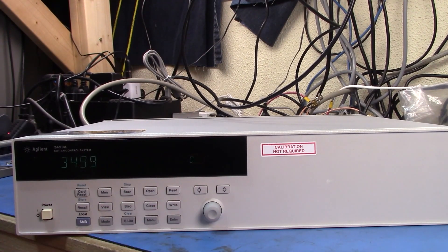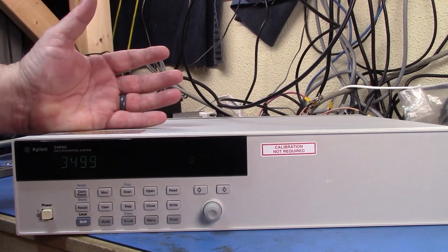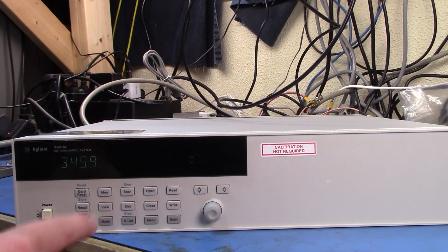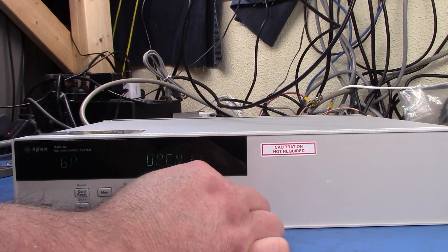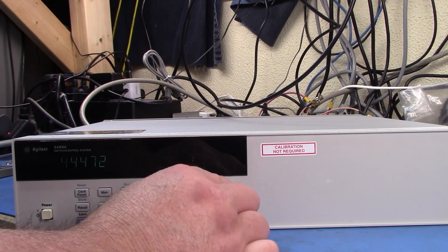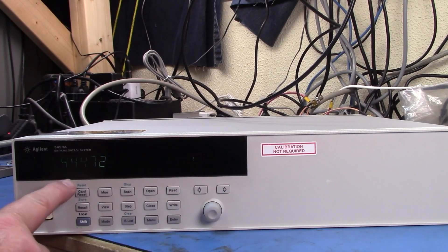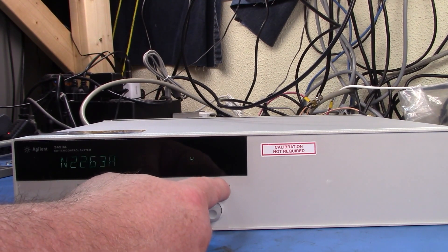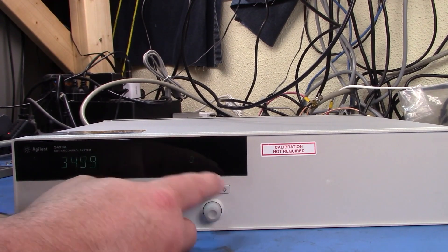With the unit on, you can control the entire thing and configure it from the front panel. But these are mostly designed to be used in automated test equipment, so it's mostly programmatic access - the front panel is a little clunky to go through. One of the things we can do is have a look at what is installed. Coming back to slot one, you can see it's coming up as the VHF dual channel. Slot two is the general purpose microwave. It then jumps to slot four - reading those 32-bit DIOs - and the 3499 itself is in slot zero.